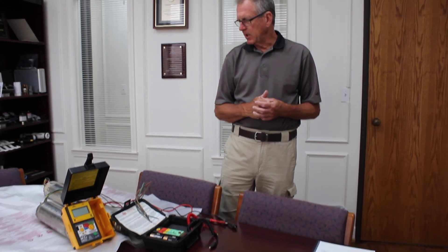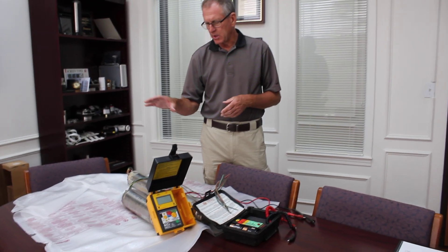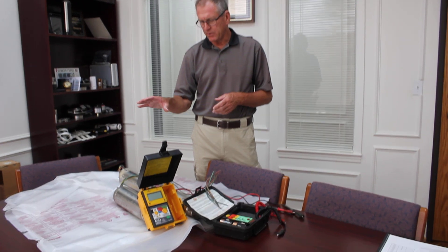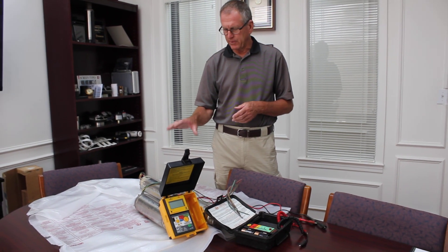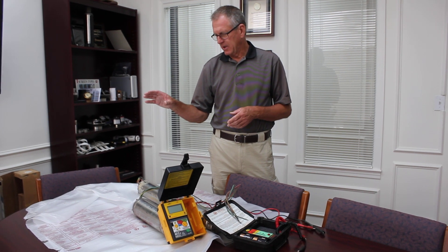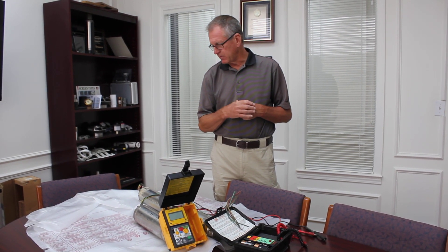You don't want to stay there, but it won't hurt you either. Also, if the motor is shorted, the case will be electrically hot, so we don't want the motor on a conducting surface while we're testing. Wood or laminate is fine, but not metal. Metal is conductive and we don't want that.